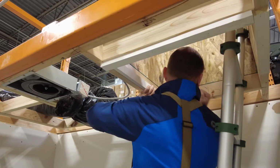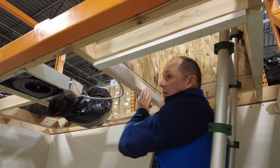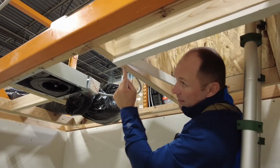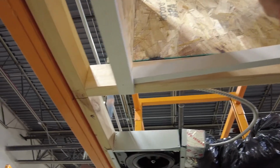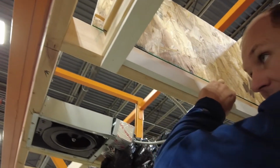Could be a lot of things. This board, this header, is probably in like this a little bit. I probably measured the top, and so we need to be exact. This can have a little slop in it because, look over here. See this trim? Yeah, it's kind of sticking out. Can you see that there's a gap? No. You can't see there's a gap, but I can probably put 5 playing cards in between them. Right. So these don't have to be snug, but if you make them perfect, they'll be perfect. Nail gun me?